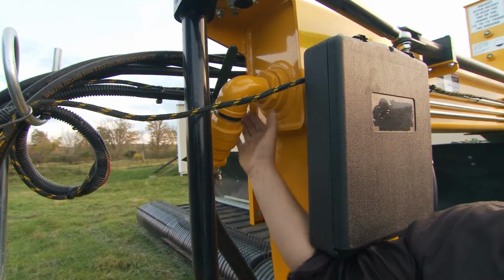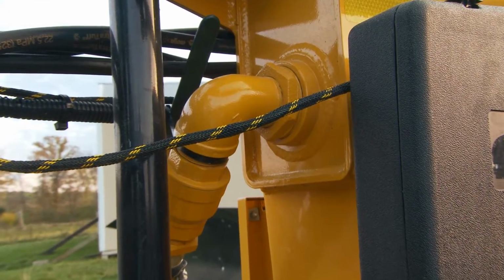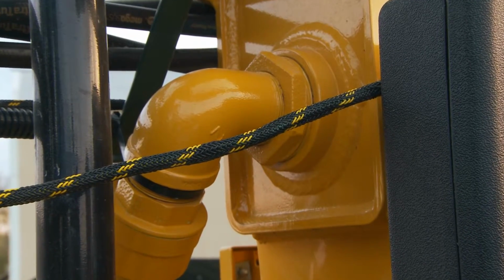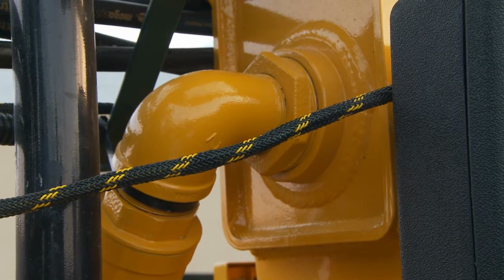Located in the front of your oil beam is a suction screen. This is a 100 mesh steel screen that directly feeds your hydraulic pump. We recommend taking the screen out and washing it every time you change your beam oil.